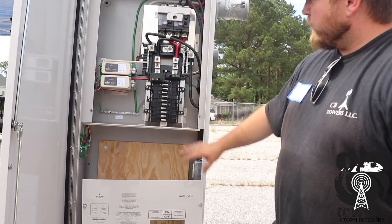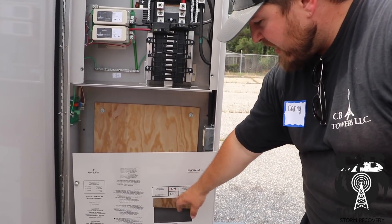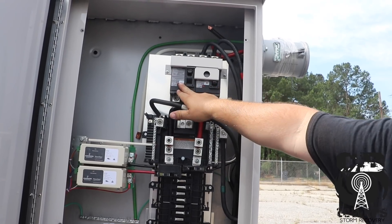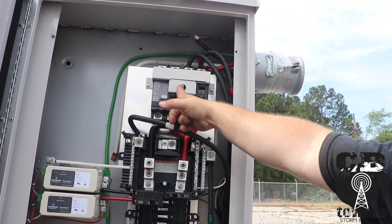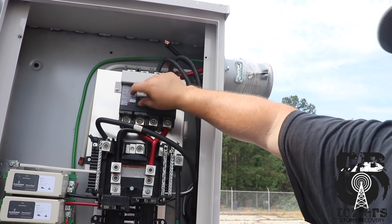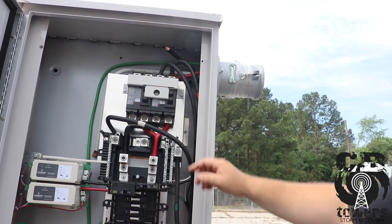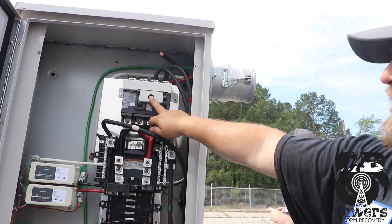This panel cover will be up here. AC power — that goes to the meter. Generator power — that's what we're going to be running off of. This will be your AC power breaker; cut it off. Throw the safety over. Cut this on. With it like that you cannot cut the other one on, so it will not back-feed or burn up anything. If yours is not like this you might have something different — it's the only setup I would trust.